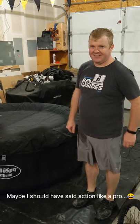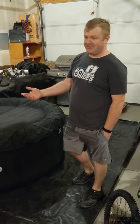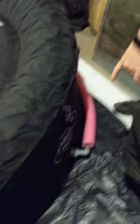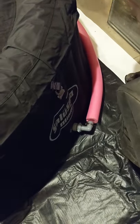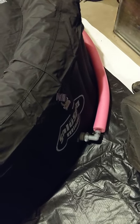So first hot tub hack: I discovered that on the back side there's a hose running from about a quarter of the way around back to the filter heater, and that's going to lose a lot of heat. So my husband grabbed a pool noodle — kind of funny because it's a hot tub pool — split it open, and just wrapped it around like a piece of insulation. It should help keep our hot tub a little bit warmer.